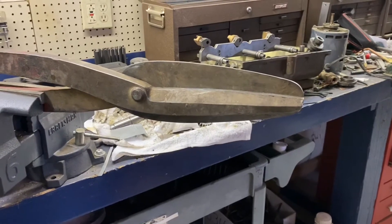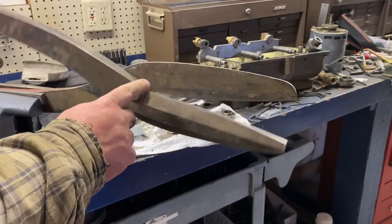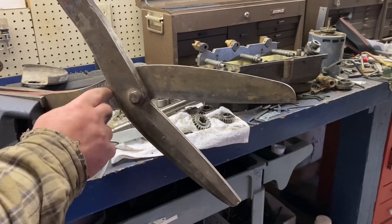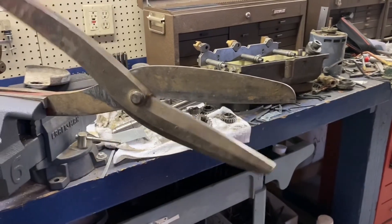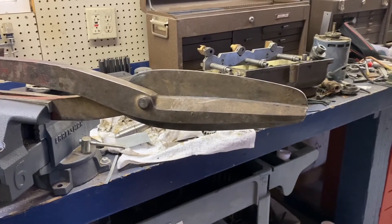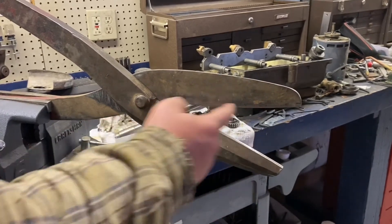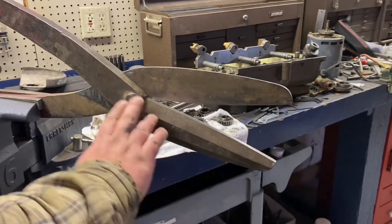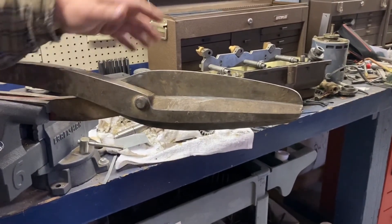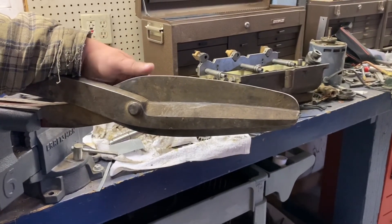I do pretty much the same thing on the smaller ones. Sometimes you'll notice some tightness — these bigger ones are adjustable with a nut on the other end. Keep that part lubed and it'll operate a lot better. When they're really rough, sometimes I'll take a grinder to establish new edges, then file and stone them and they should be good to go. Quick little video on shop maintenance — this is Adam from Small Town Machine Shop, please comment, like, and subscribe. Thanks for watching.